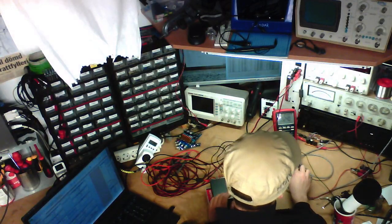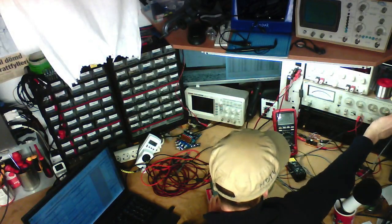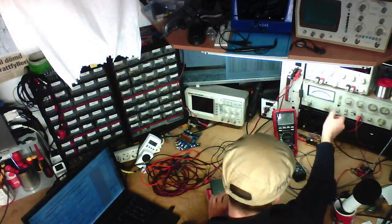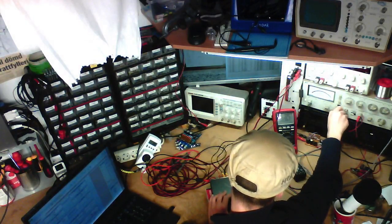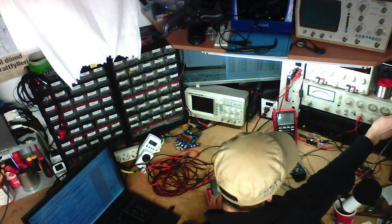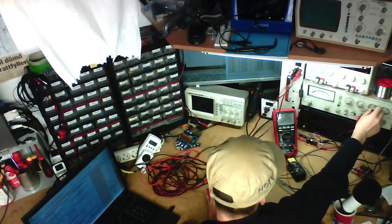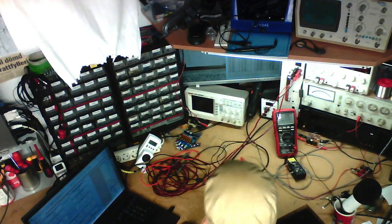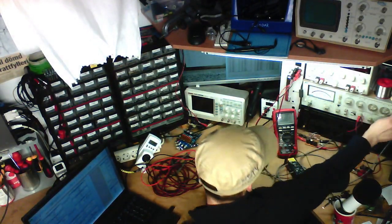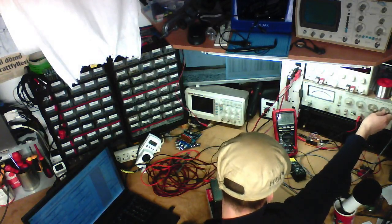And now we're going to do the same thing for the right channel. So I want to go back to 1 kilohertz. Adjust the relative level to be exactly minus 4. And low end. Now that's going to be 9 Hz as well. And I'm wagering my best that we're going to have a 21 kilohertz limit on this one as well. Yep.